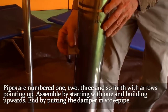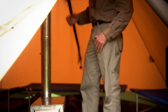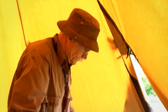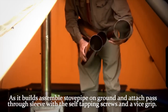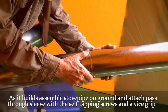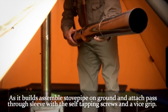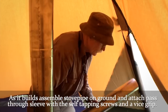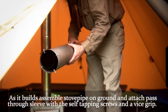You can see the damper slides in and out — very simple, very efficient. Now it gets a bit higher so I'll put these three pieces together first. On these 20-inch sections we need three pieces; if we were going into the number 15 we'd need a total of eight pieces. Now we have to put our pass-through sleeve on — we don't know exactly where it's going yet, so we'll just get it on here.